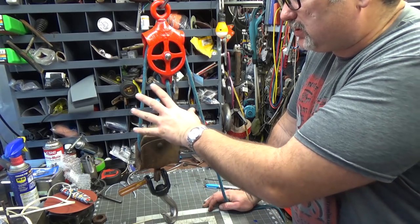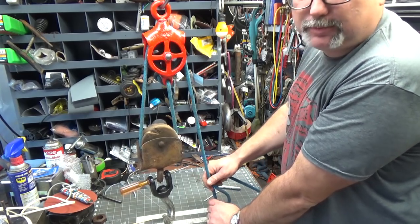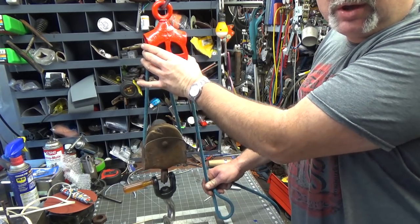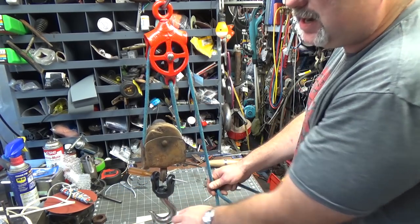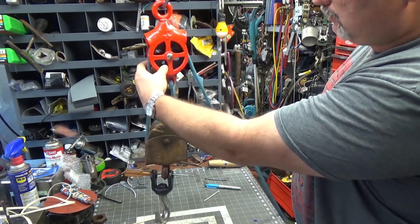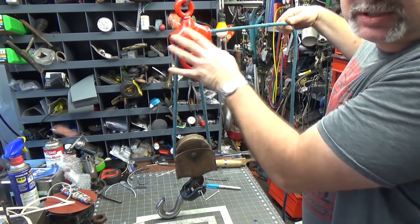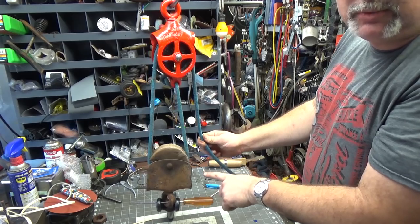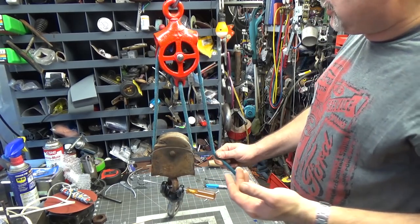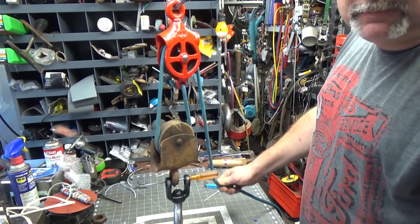Depending on the orientation and which pulley is fixed, you can have either a two-to-one or three-to-one mechanical advantage. The important thing when you're out in the field is to make sure that whatever force you're pulling with — whether by hand or a truck — is also pulling away from the load. You want it moving toward the static end. Otherwise, you're simply redirecting the force: you still have a hundred pounds here, a hundred pounds here, a hundred pounds here, but only two hundred pounds working toward moving the object, and you've wasted that third hundred pounds. Moving your orientation can recover that extra force.